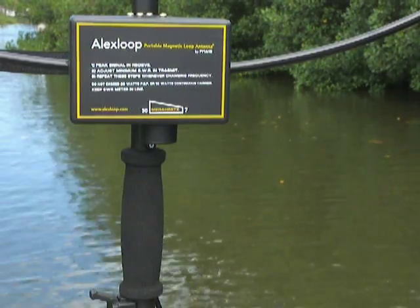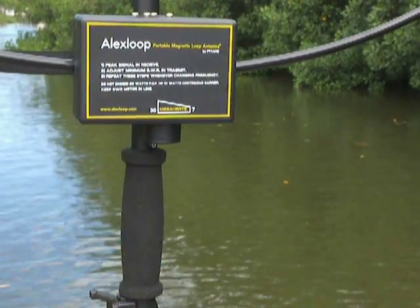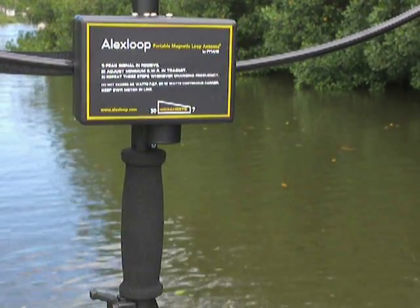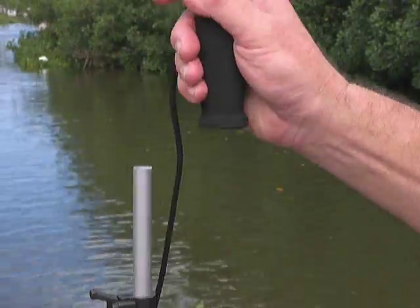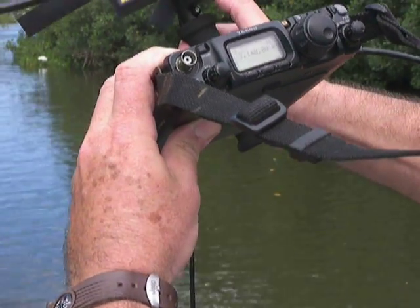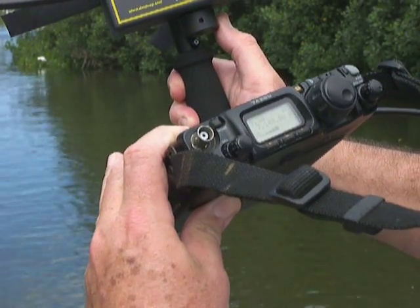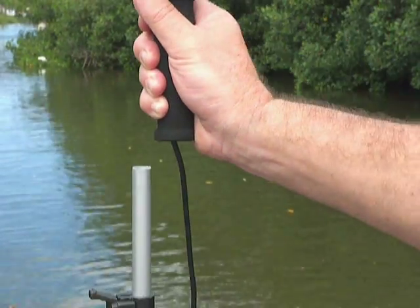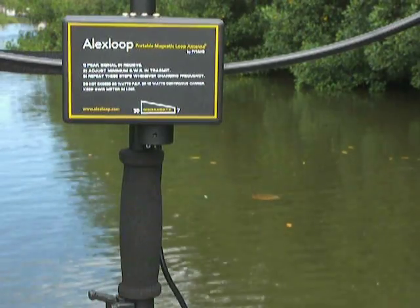The antenna has a very handy handle that you can hold and tune. To hold and tune, just do this — let me put it on AM. The antenna is tuned only with the thumb. On 7 megahertz, find the highest noise level, and the same on all bands. The highest the noise, the best the standing wave ratio. You can almost always tune it just by picking the noise level on receive.